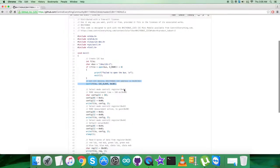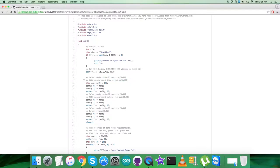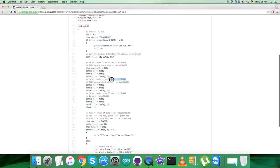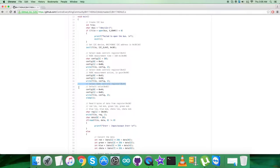The address of the sensor connected is 0x38. In the writing section, we send commands to the sensor: we select mode control register 1 at address 0x41, sending the command for RGBC measurement time of 160ms, which is 0x00. Then we select mode control register 2 at 0x42, sending the command to activate RGBC measurement at 1x gain, which is 0x90. Next we select mode control register 3 at address 0x44, sending the default value 0x02.